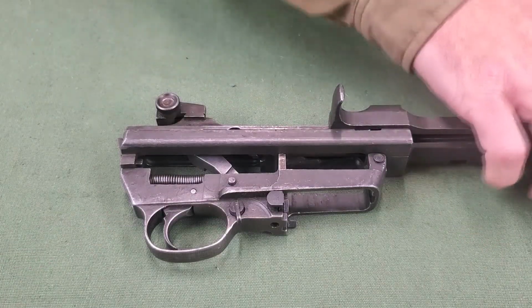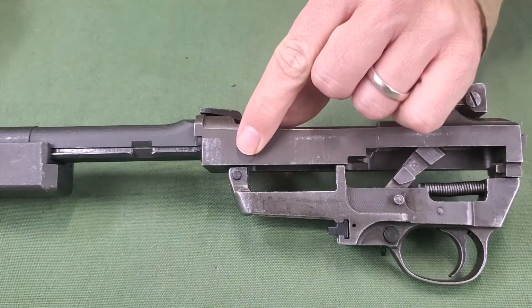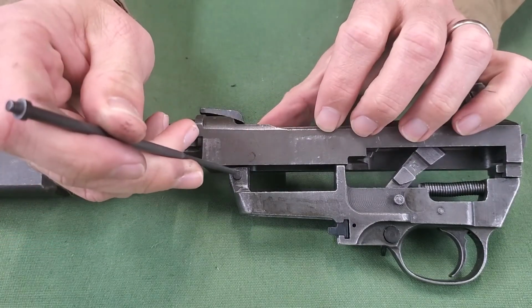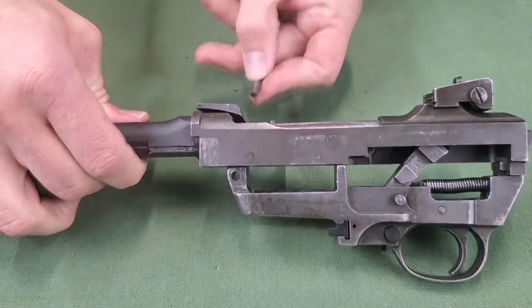Turn the barrel so that the operating slide handle is down. Punch the guard assembling pin from its seat by starting it with the small end of the operating spring guide rod. Pull out the pin from the far side.